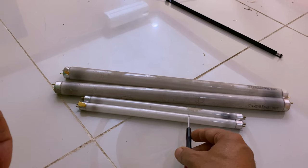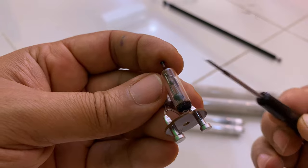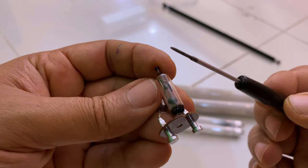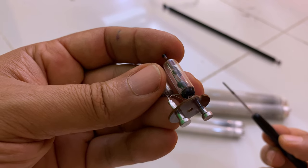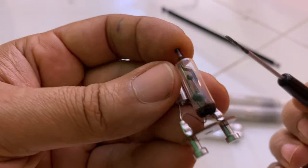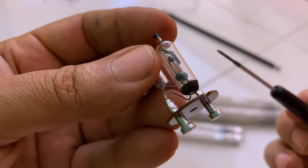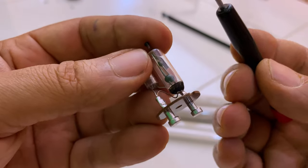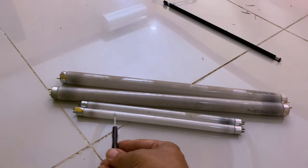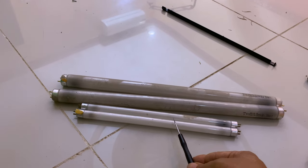And so the voltage here drops because there is a short circuit that will cool the gas inside, which will also cool the metal plates inside. If you can see them, the plates, all right? And so they will separate from each other and cut off the starter, but the power will continue because the tube is now on here, okay? That is how this one is illuminated.